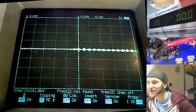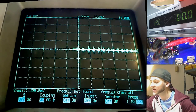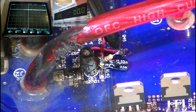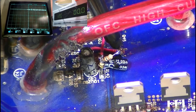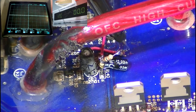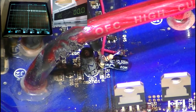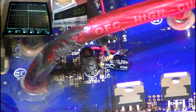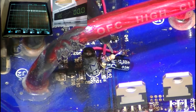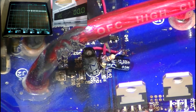I've just noticed there is quite a voltage difference. I think this amplifier has a weaker circuit. So I'm going to probe the input to the capacitor. 5 volts essentially, or 4.2 volts. 4.2 volts gets sent to charge the capacitor, but by the time it's been through the diode and resistor, it's actually only at 3.4 volts. So what I might do is reduce the value of this 10k resistor to maybe a 1 or 2k resistor, and that'll get the capacitor charged up quicker and up to the full 4.2 volts.